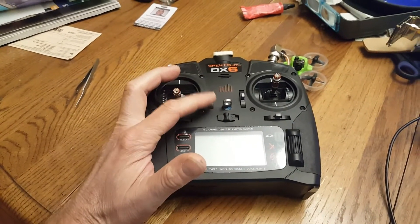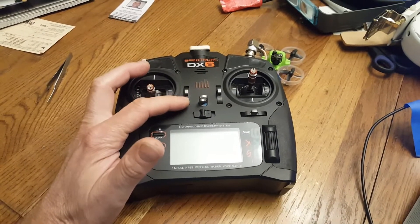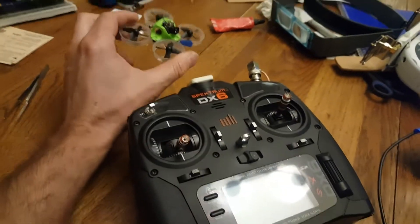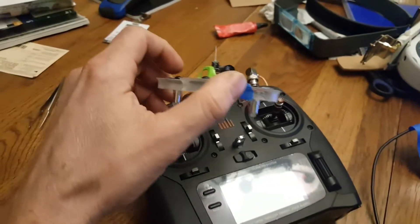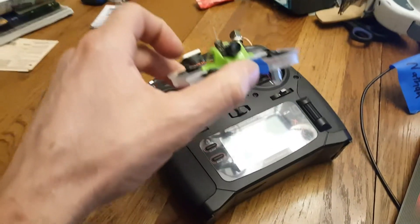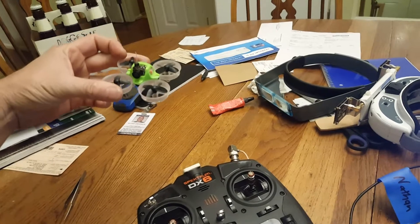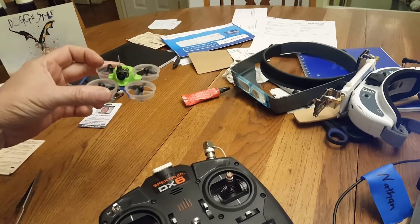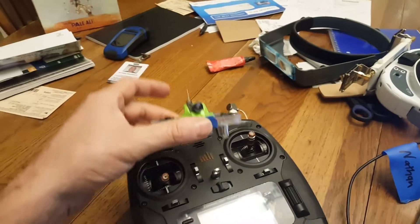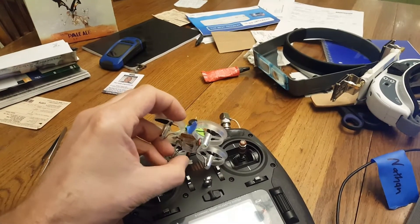To power it I have to use a two-cell lithium pack that they make for this transmitter. By going from 100 milliwatts to basically 1300 milliwatts you get a 4x increase in range, so it should be about a mile range, because the range was only a thousand feet at 100 milliwatts. One of the biggest reasons for reduced range with the tiny whoop is the wimpy antenna, and the antenna is in the worst position — it's horizontally polarized, which is pretty bad because if you're flying towards you you're going to have some reduced power.